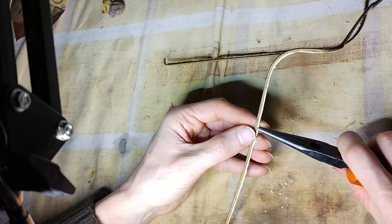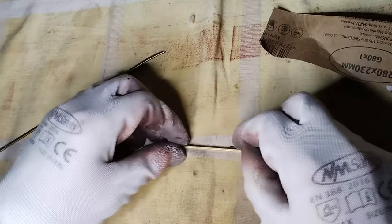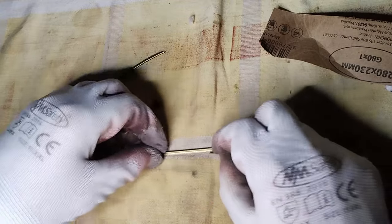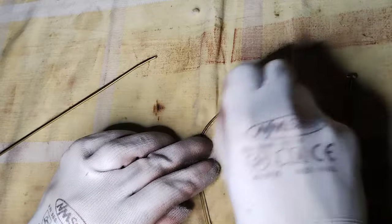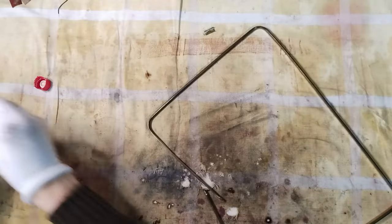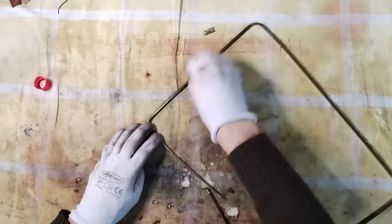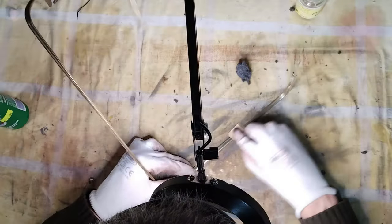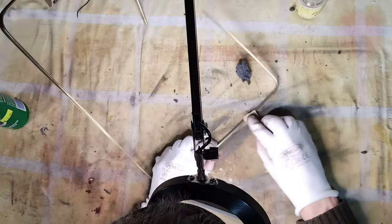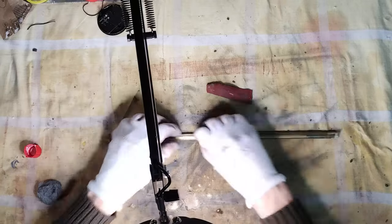All the decorative pieces needed to be cleaned. The brass-like plastic decoration had residues of glue that needed to be removed. The brass frame was brushed initially with metal polish and fine steel wool, but later also with fine sandpaper. The remaining decoration pieces were cleaned in a similar way, and the following clips should be self-explanatory.